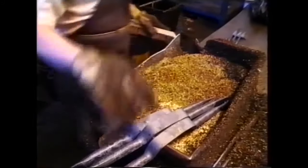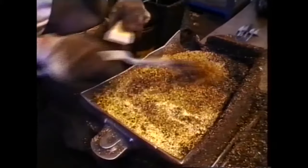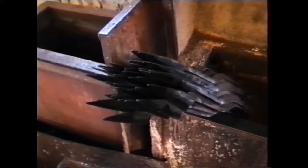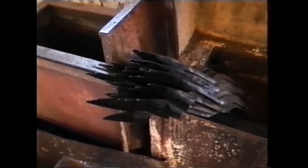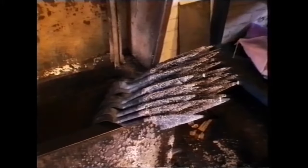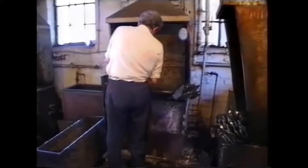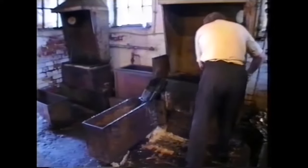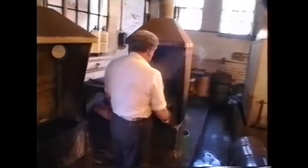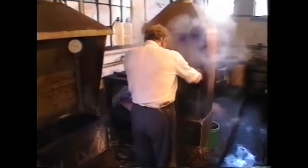The reason they have to be tempered is because when they're hardened, apart from the edge being hardened, some of the hardening runs right through the blade — consequently the blade would break. They're tempered at a temperature of 235 degrees for about five minutes, depending on the size of the shear and the width of the blade. After tempering, they're drained off, then washed in a solution of boiling water and industrial soda.